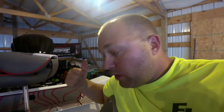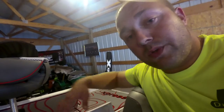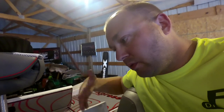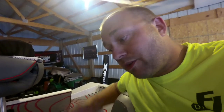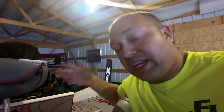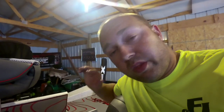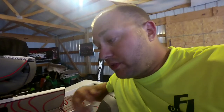Once the light was fixed, the next issue was that there's no sealing on the live well lid edge, so in a sharp turn all the water would flow out the sides or back of the live well. I put weather stripping around the edge, which took care of the problem. Now my live wells hold three-quarters full no matter how rough the lake is — I was out on a rough Saturday and they stayed three-quarter full all day. That was my biggest gripe as far as the live well goes.